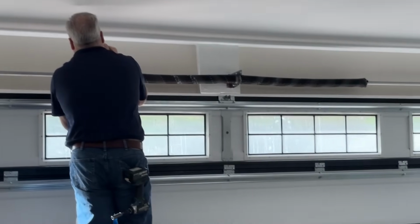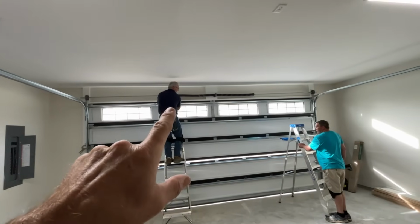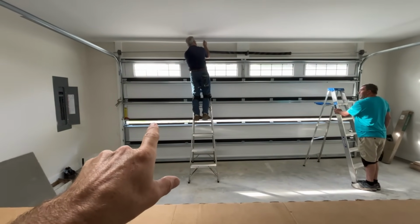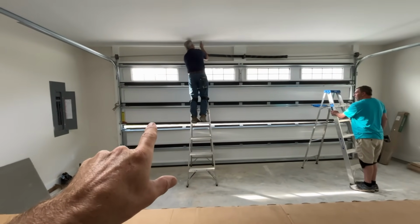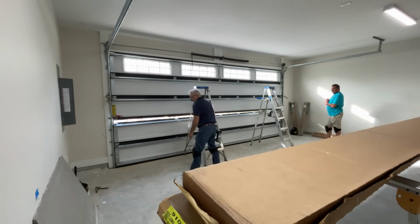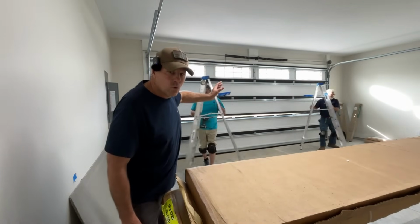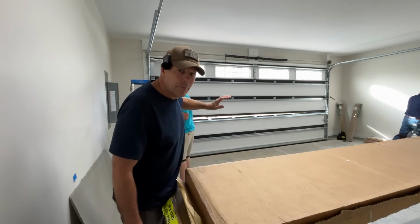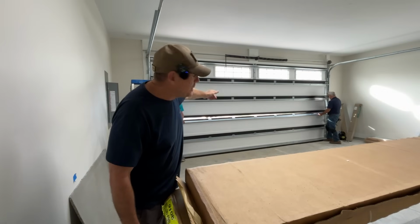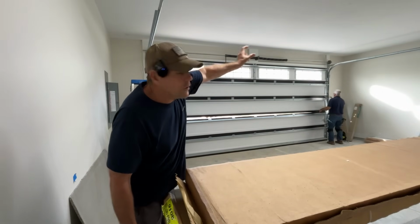And that's the most dangerous part of a garage door, is that spring right there. He's gonna let that tension off so that he can separate these panels. You can see the three good panels. He's got one bar holding in that, and he said if that flies, it'll go across the garage, hurt somebody. So he's doing it a little bit different than I thought. I thought he was going to take the whole door apart and bring in the new panels like when you put a garage door together the first time, but he's just going to hold those top three in place, take the rollers off, and pull them out this way instead of sliding them all the way through the track.